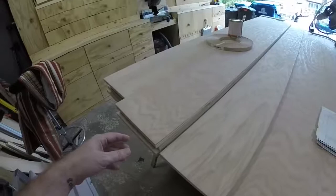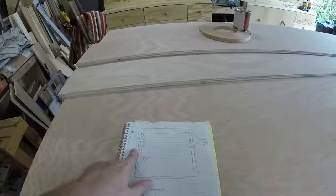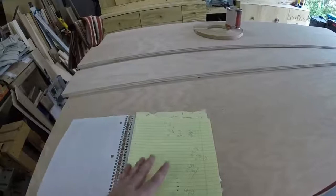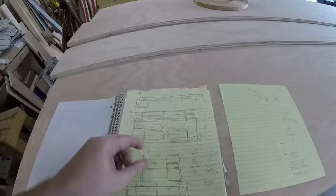I had them cut six pieces that are 10 inches wide, so the sides, top, bottom, and shelves will all be 10 inches wide. Aside from dados and rabbets in the two sides and flat against the back, I'm going to run a shelf support on the back, have the one-inch strip in the front, and then some strips down the sides to add additional stability.